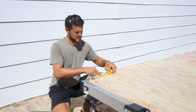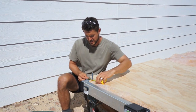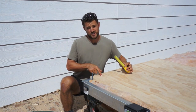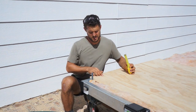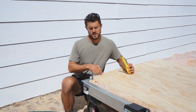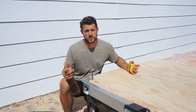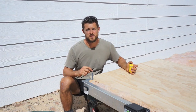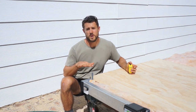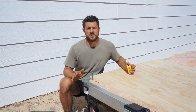We're going to measure 100mm in and put a mark on our plywood, then measure how far in from the side — 60mm — and put a little cross on both sides where these studs are going to be. Then we're going to drill a hole all the way through the plywood. These studs are M16s — 16mm — so we're going to drill a 17.5mm hole. Once the plywood's sitting over, we're just going to put a bit of silicone around it to seal it off.